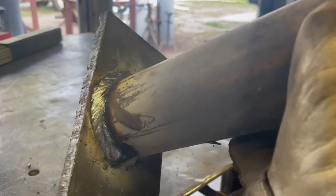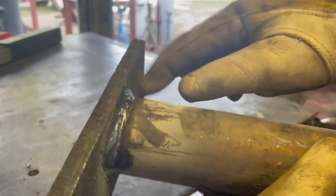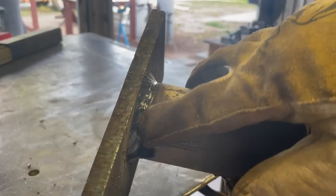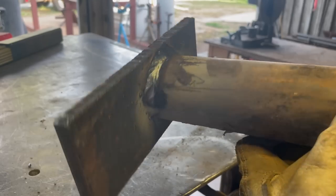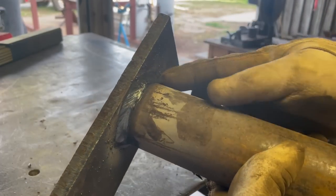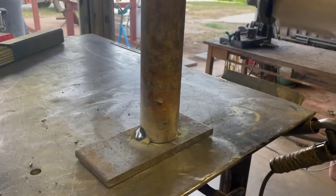It tied in a lot better than it looks in the slag, but I do have some undercut on top here. I'd venture to say that's because I'm too hot — the slag is making me want to turn it up, but from the results of the weld I clearly need to turn it down. So I'm going to go back down to 80 and run the other side.